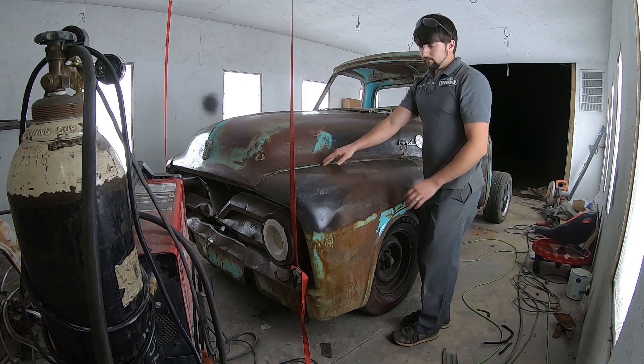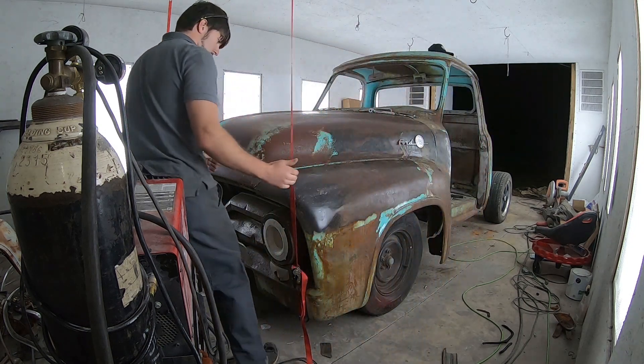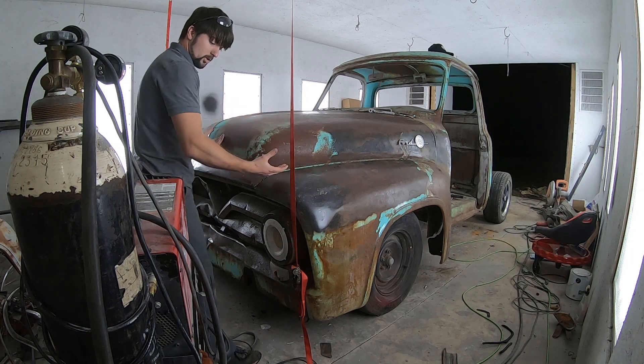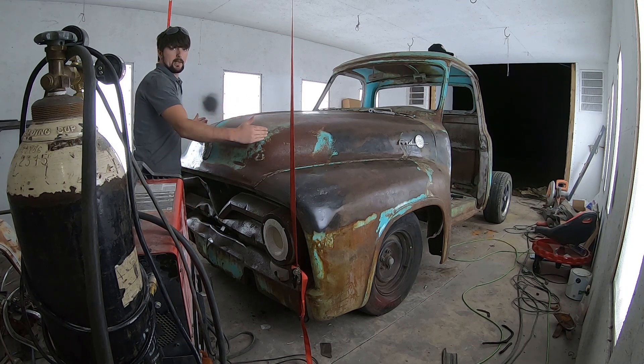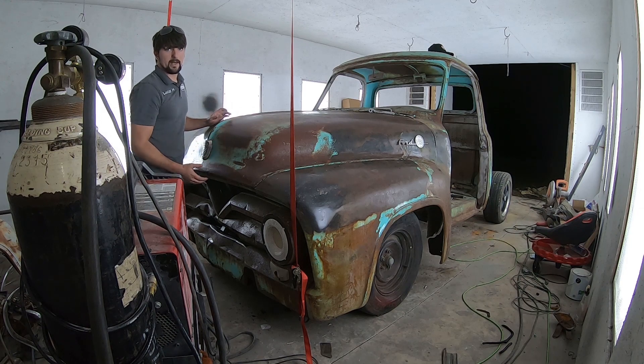What I've got to do now — I've actually cut the Ford Ranger front frame horns off on the frame so that I can make a crossmember to bolt up to the factory two bolts on that lower radiator support. I'm keeping the radiator support that's in this truck, but it's not going to be what holds everything together for my radiator and condenser — I will make brackets coming off of that.